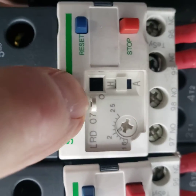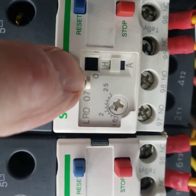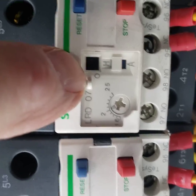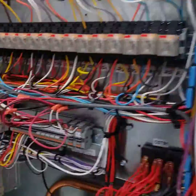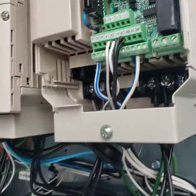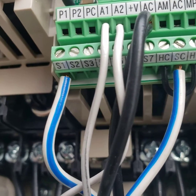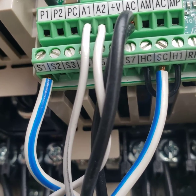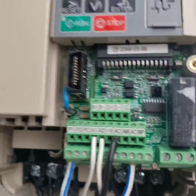This little window will show red or some similar mark when it is tripped, so that would be something to look for if you're having problems. Over here at the VFD, two blue wires — blue and white — make contact between SC and S1 to turn it on.